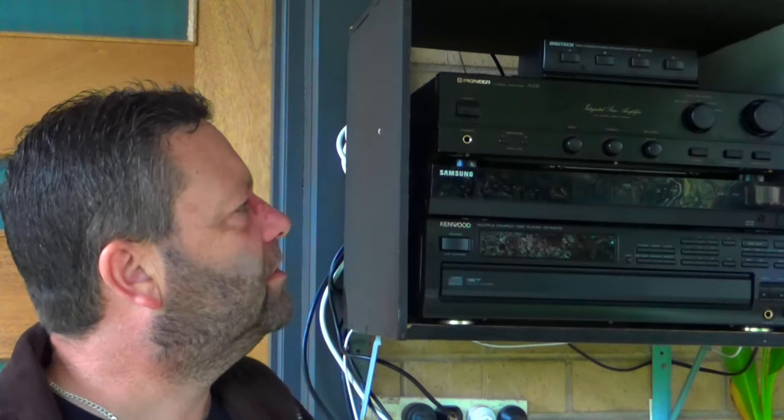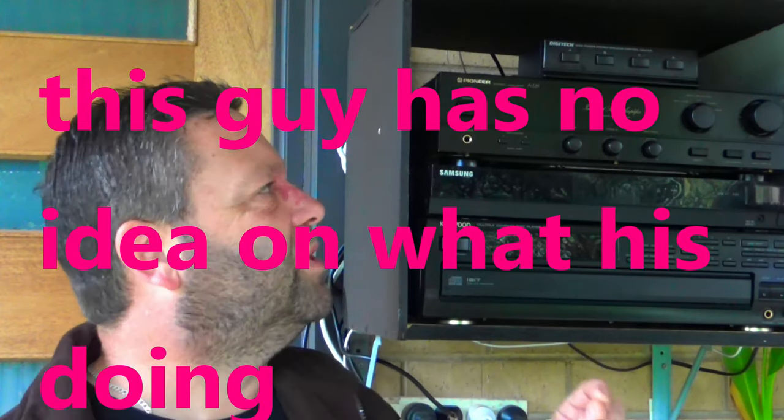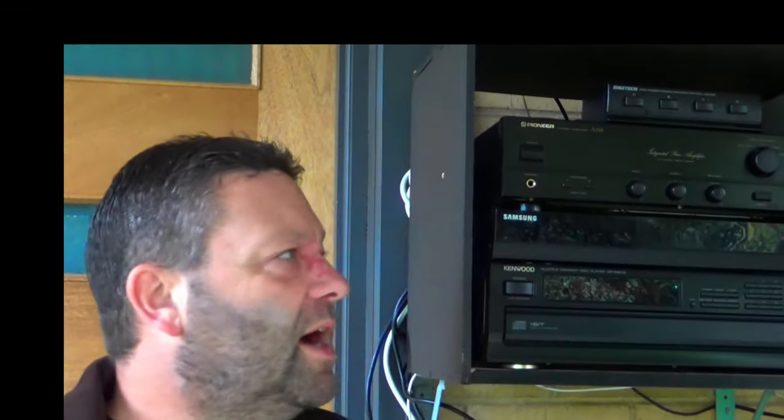In here, what I did was I got an RCA lead, and I snipped it off, stripped one end, and I went RCA out of this amp and the other end, which has stripped wires. I got the RCA lead, snipped the end, stripped the wires, and what I did is, because this has A and B, I'm only using, say, A, you know, for all the speakers that go into the switcher box up here. So I went, say, B left channel out, with the RCA plug, out of this amplifier, stripped the wires, and I went into this.